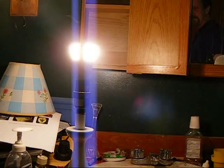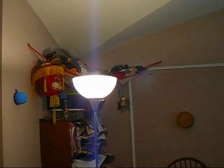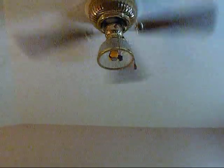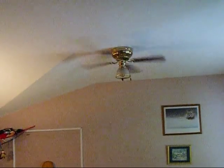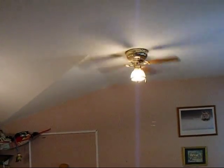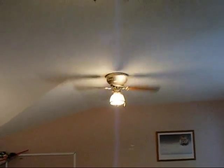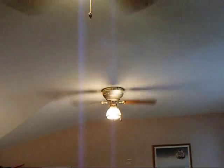This is Andrew Perkins from dabblings.net. The Philips bulb in a tortiere — or however you pronounce that — actually comes out quite nice. You don't see the shadows from the heat sink; it works out very well. The downside, as you can see by this light up here, is what we used to have a problem with with fluorescents as well: when you turn it on, it takes just a little time to come up, about a third of a second. That can be annoying, but for the amount of savings you have, if you're going to put it in a light that's up and far away — something you don't want to have to replace a whole lot going up and down ladders — that's a very good light to use.